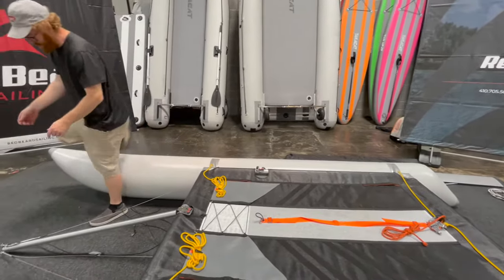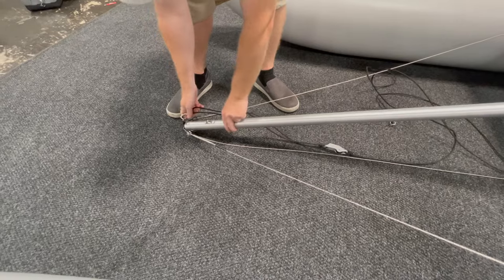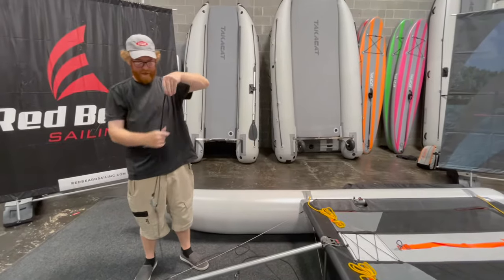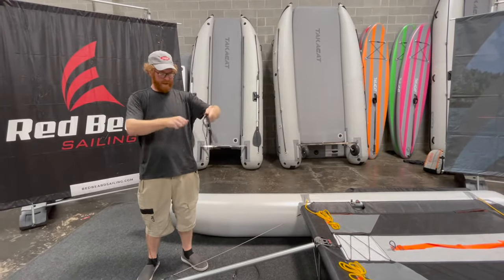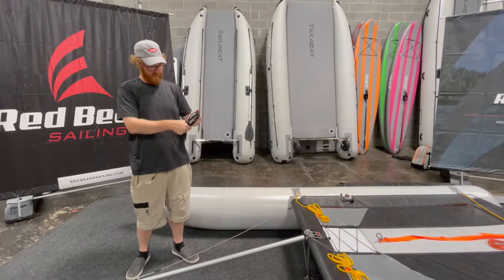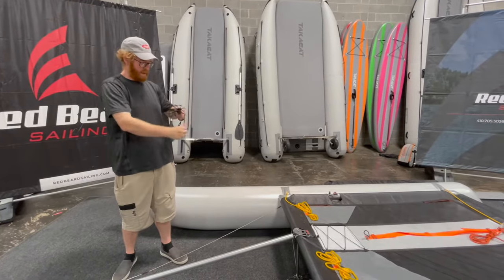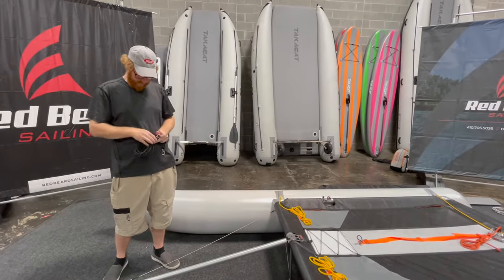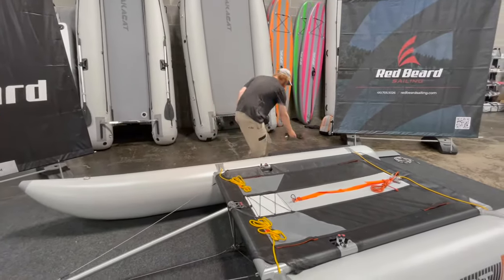The forestay is the last of the standing rigging that we need to do. You just use another carabiner like this, unclasp it. I take this at full extension — this is my loop guide. So I take my first loop, just like that, and then continue making loops that same size. Pinch these together into a bind — and this should look familiar, just like we stowed the halyards. You might have to stop a little bit earlier because you've got to fit this shackle under that little loop as well. And then you have a nice terminated line. Set that aside with your two halyards.